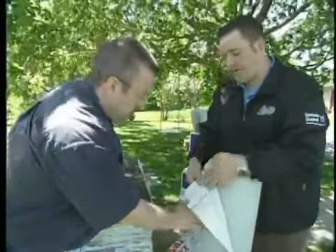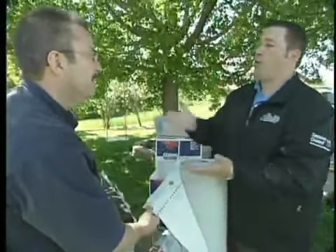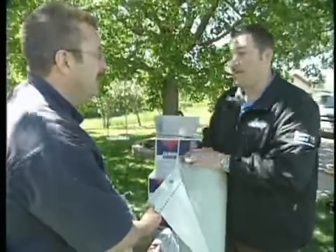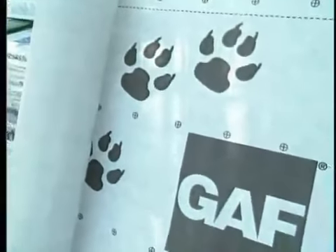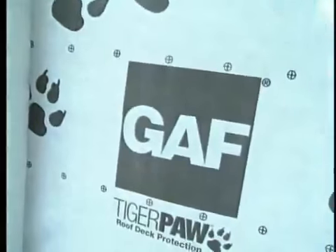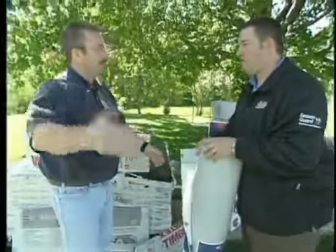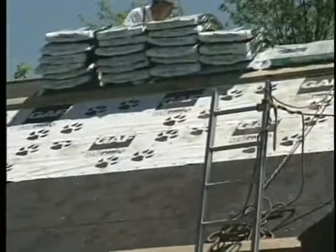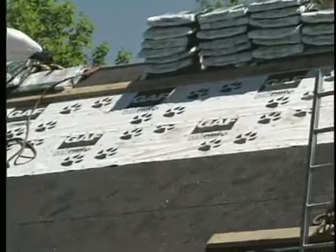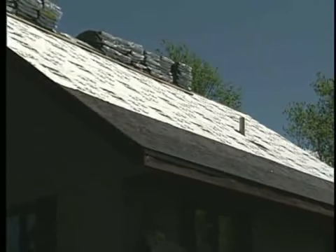Feel the backside of it — compared to the front side, it's actually moisture wicking. So if you have any moisture in the actual roof deck, it's going to pull that out of the house and really start to alleviate any type of mold problems. Moisture is the number one enemy of a house, and this product really shows the evolution of the industry. You want to make sure you have this side down. It's going to be a lot easier to walk on than any type of felt out there, so it's going to be safer. It may cost a little bit more money, but you don't have to worry about the moisture in the wood or creating cracks from the tacker. Again, workmanship and peace of mind.